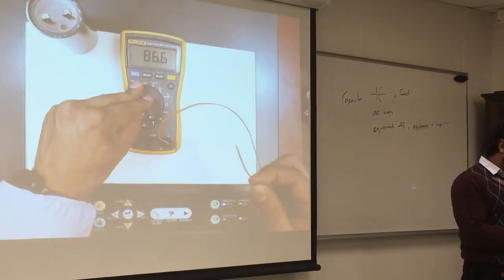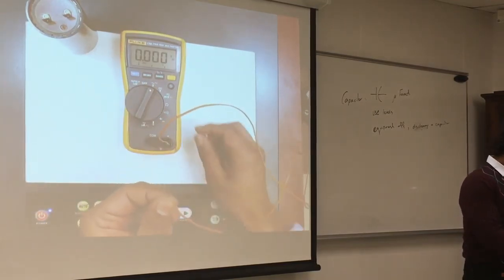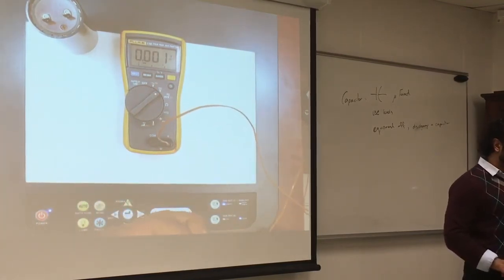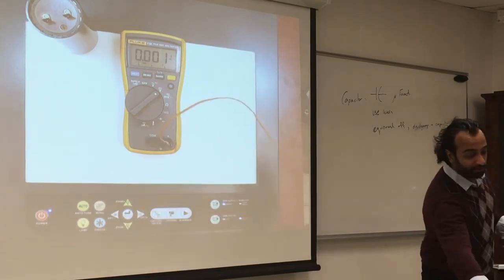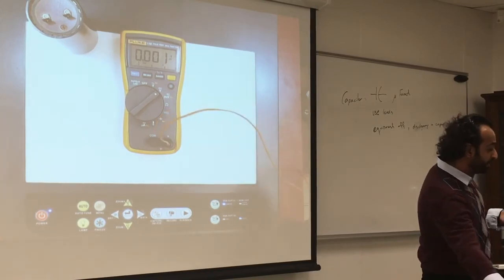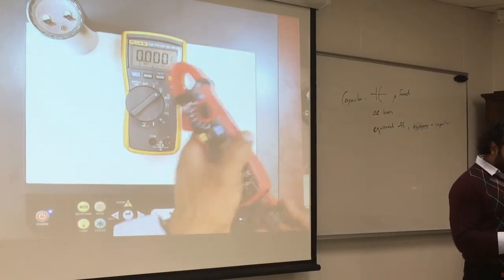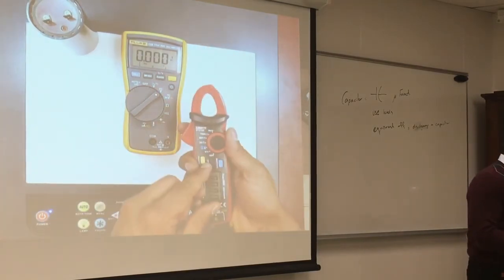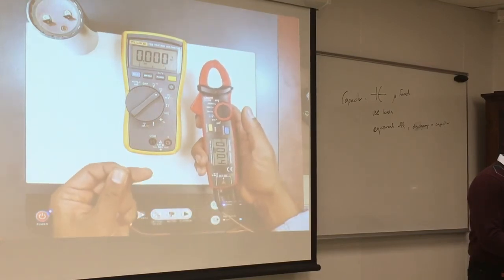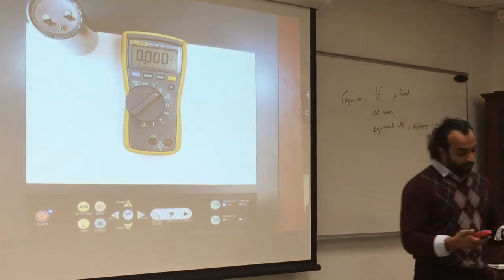So just to show you, if you go to voltage, there should be some voltage here. See, 0.01, that's DC. This has been calibrated to tell you what the 0.001 corresponds to in temperature. If I put these leads in, hopefully they fit, yeah they fit, and I go to voltage here, I should be getting something. Yeah, 0.4, 0.5 millivolt. So it's very, very small, and it's a very sensitive one.